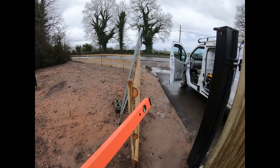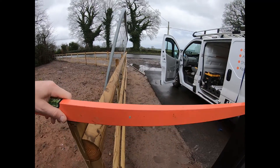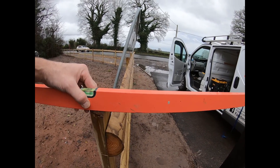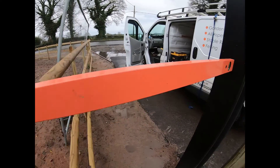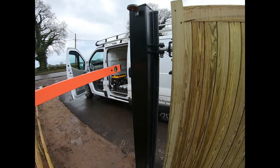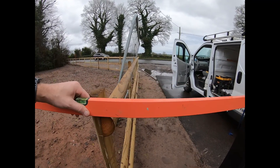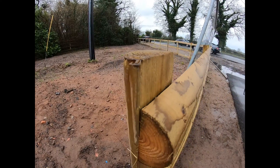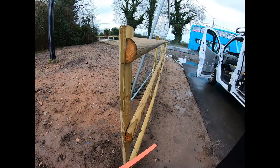So what I need to do is find the height that I want my piece of timber to be attached to the post. I've got a long level — longer than the gap itself — got ourselves level there. It's hard to do this 100% level. Then I put a mark underneath the level — you may just see a faint pencil mark. So that's the level I want the piece of timber attached to the post. I'll do the same on the other side of the gates, measure the distance from the top down to the bottom of the top rail, and keep going down, spreading them evenly across.